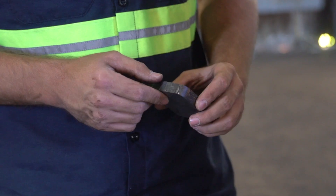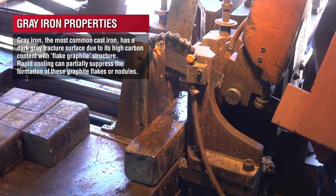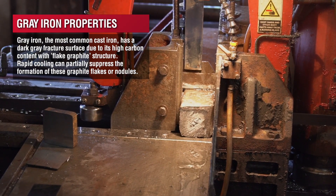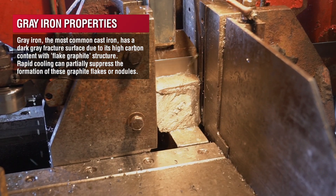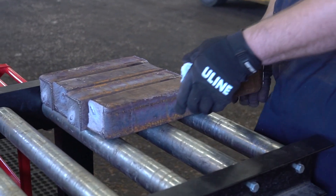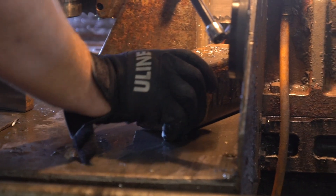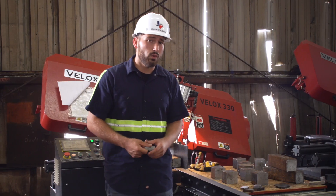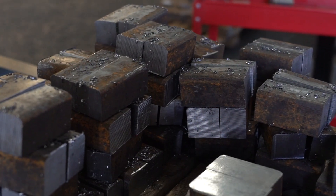Gray iron is a cast material, so it is a little abrasive. It's going to be like cutting 4130 or 4140 chromoly as far as the time to cut and the surface inches cut per minute. This job has multiple line items with a thousand plus pieces per line item, and it being a square part, you've got four trim cuts to make — so this is well over north of 8,000 cuts on the whole total job.